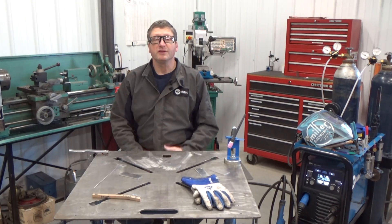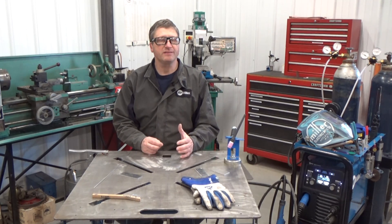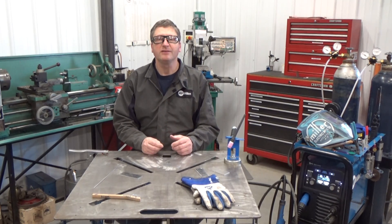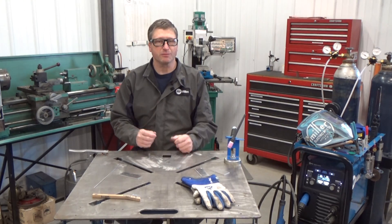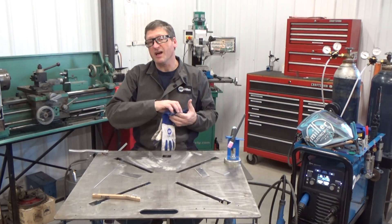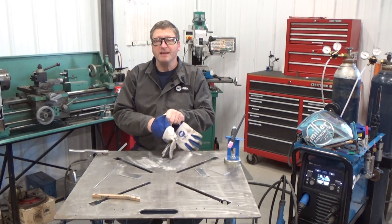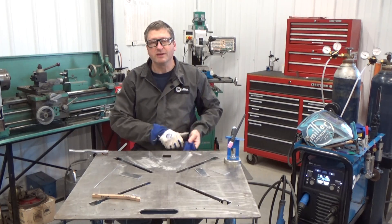The first thing I want to do is work on technique. Here are some dry exercises to help train your hands to work independently. First, sit down and get comfortable. Put on all your safety gear, including your welding helmet. Get yourself in the same situation as if you were really going to start welding.